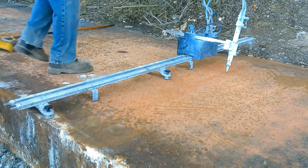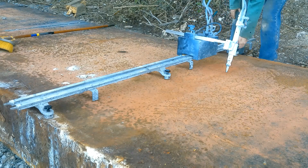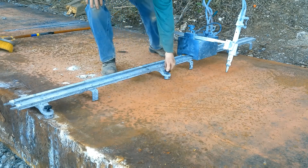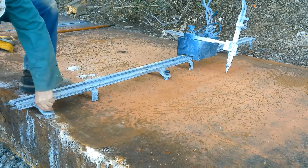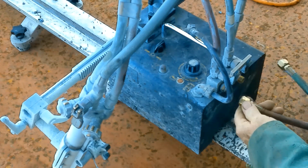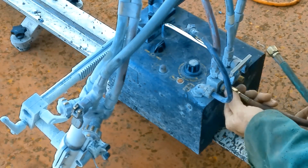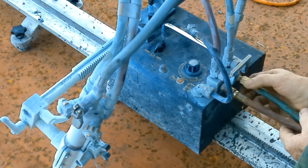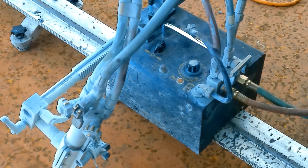We're going to be using the Gopher 3 as a track cutter, and we're cutting every eight feet. I have this all lined up and we're going to go ahead and set the magnets in. More than eight feet and our forklift can't really handle it too well. We're going to go ahead and connect the fuel and the oxygen — the red is the fuel. When they have the little notches in the nut, that's a reverse thread, so we're doing exactly opposite of what comes natural. This will take probably twice as much oxygen as a normal job.